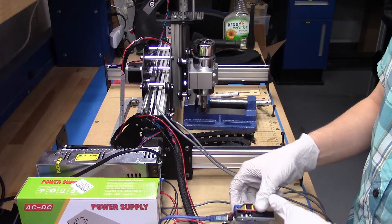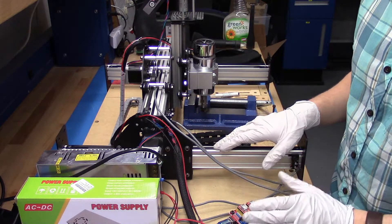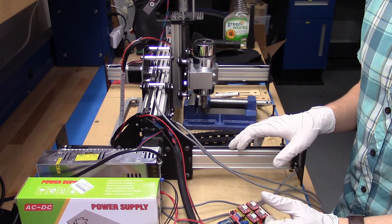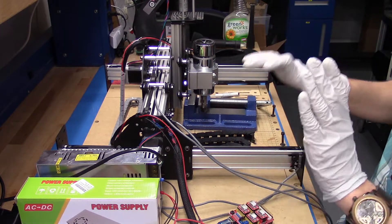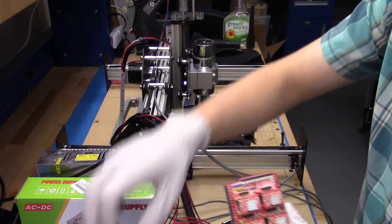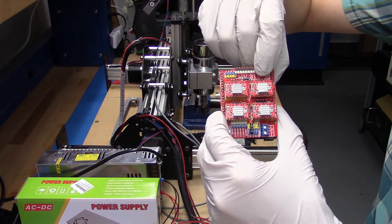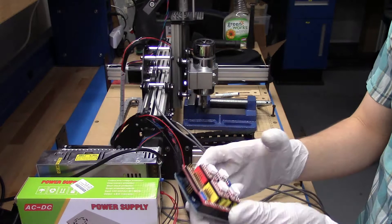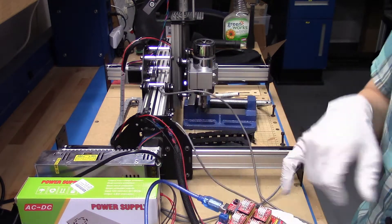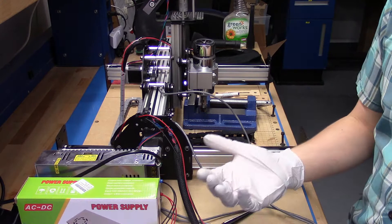Now that I've got this working, I've been CNC-ing a lot — it's been a couple of weeks. I've been working with aluminum as my first-choice material, though I've also been working with foam and some plastic. I prefer aluminum; I think it looks better, though you have to go really slow and it's tedious. I also have to re-pin the wires coming out of the driver board because they're not pinned — I need to put them on the little headers. That's just going to be a little tedious. I also have to do the same thing for all the limit switches to connect them up. There are six total spots: plus and minus, so it knows where its absolute limits are.